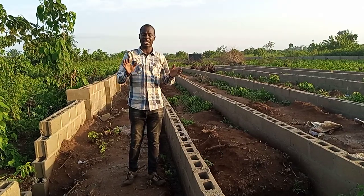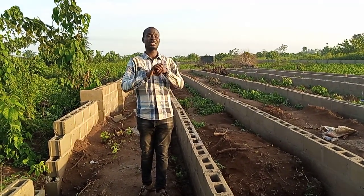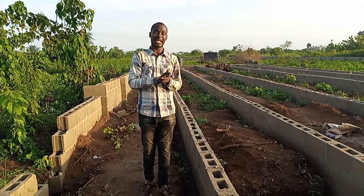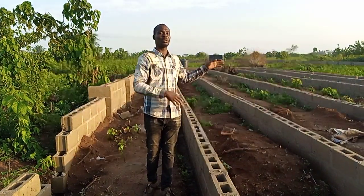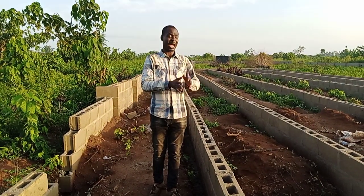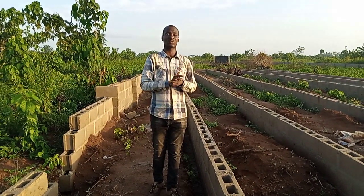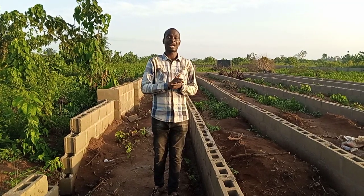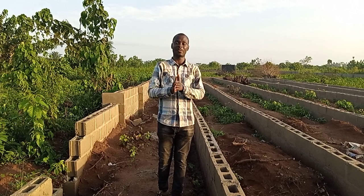This video is specifically done for our clients so that you understand what we want to do. In a nutshell, what we need is 20 pillars of 12 feet high, so that we can put pillars on the building before we do the roofing. After putting the pillars, the next thing we are going to do is to fill it. After we finish filling it, we will cast the floor, before we talk about the roofing. So these are the steps involved for now.